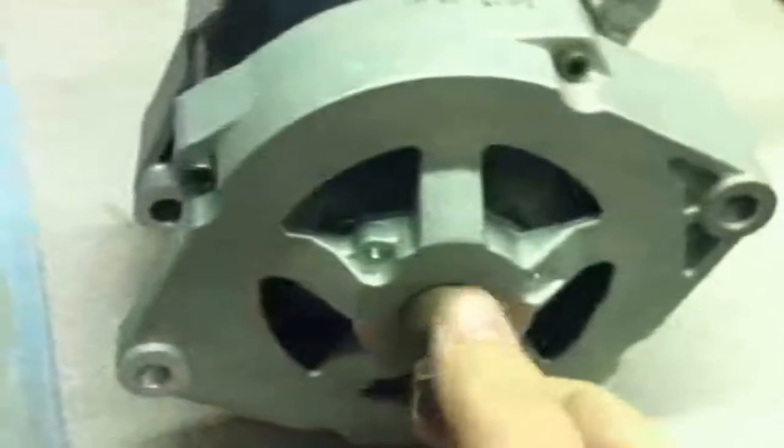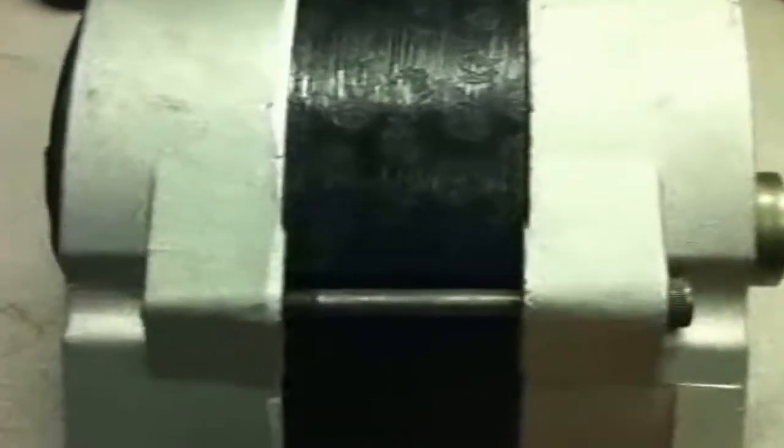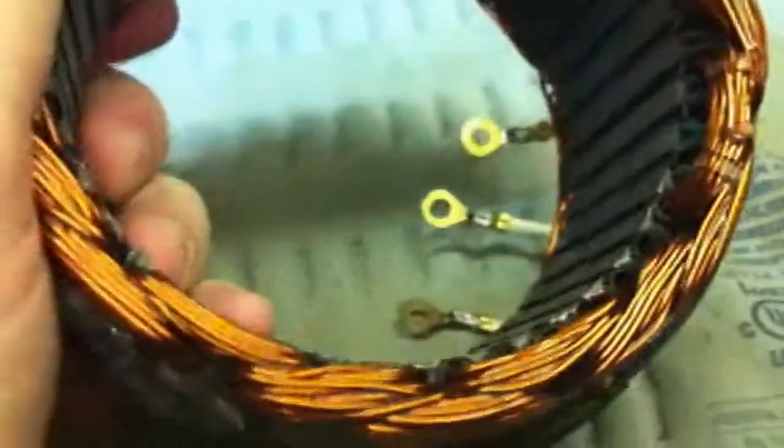It's got a nice small profile but it's got twice the magnets — this is our double wide rotor and double wide coil. We've packed it all in a little area only an inch wider than a normal permanent magnet alternator or permanent magnet generator, and this one is packed full of copper. This coil is very heavy.